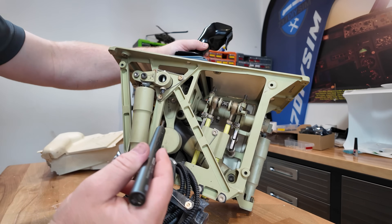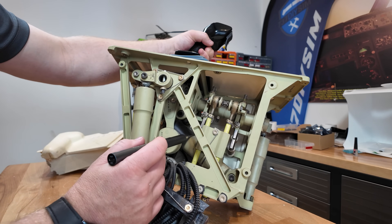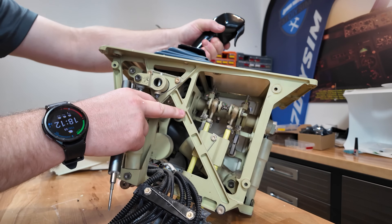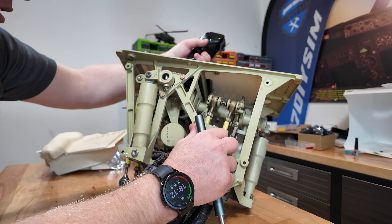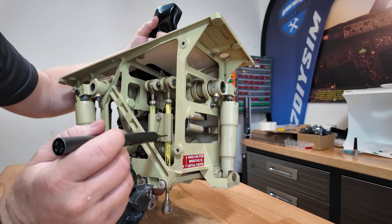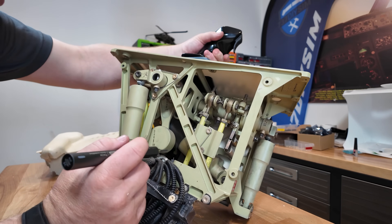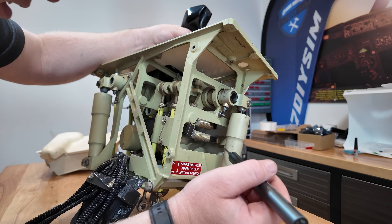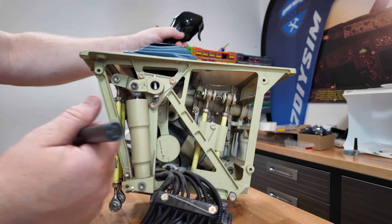So for the pitch, straight away there's a counterbalance weight here. There are two huge dampers - not only two compared to the one in the roll channel, but two large dampers for the pitch lane, and it really does take a huge amount of force to push it fully nose down. The pitch lane is really stiff. Where is it getting that tension from? I'm going to guess that these two large units in the middle house springs inside them - that's what sets the tension - and the damper just slows down the movement.